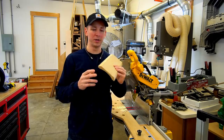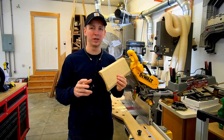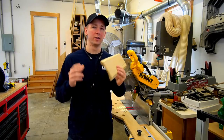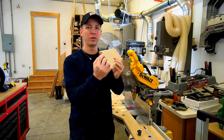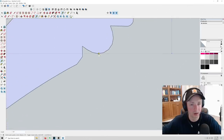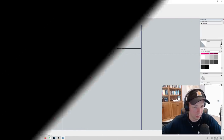You might be thinking: what do you mean that the crown molding can't be coped? I thought anything can be coped. Well, actually no, it can't. There's some very simple geometry involved in coping, and if a profile passes certain planes, it can't be coped. That little section up there where it comes up past horizontal is gonna make this profile not copable.